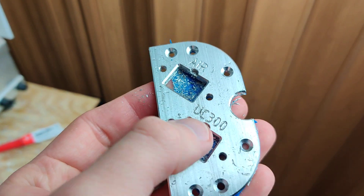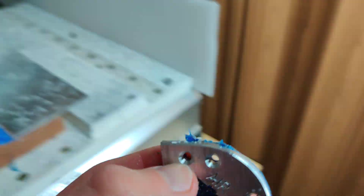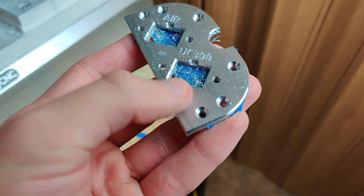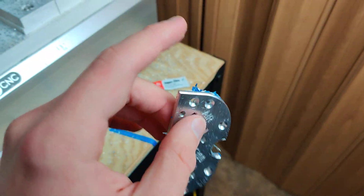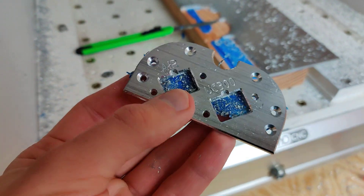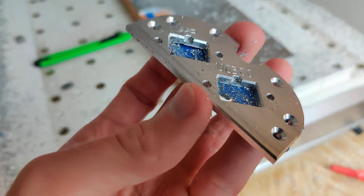I thought I was feeding too fast on the engraving. I started doing counter sinks with just chip break drilling on the chamfer tool and it's been working out great. I used to get chatter but I slowed it down. I'm going to share in the description the speeds and feeds I used for this part. Let's see that sidewall finish.